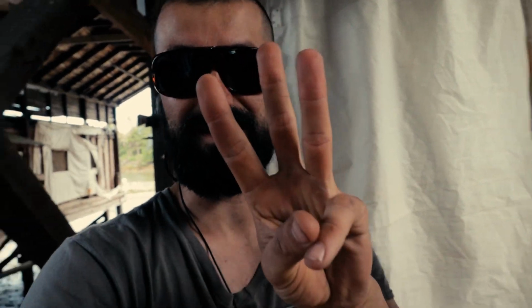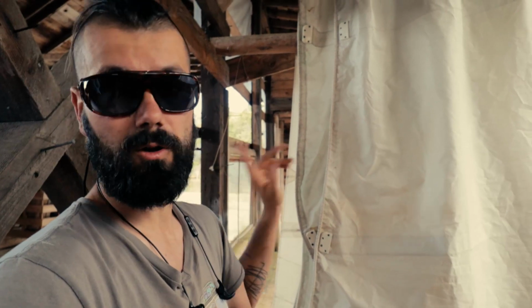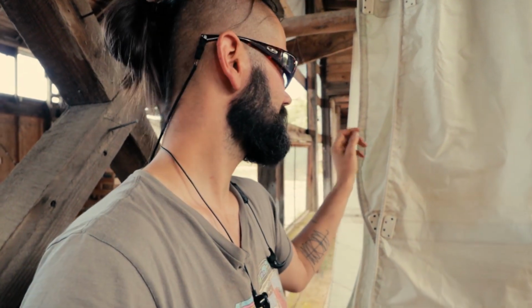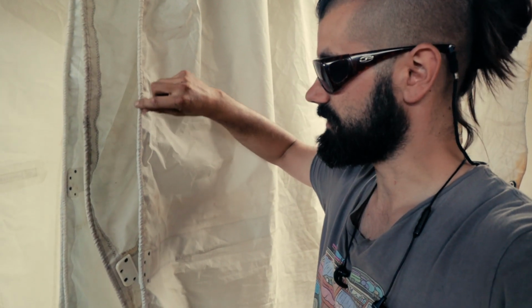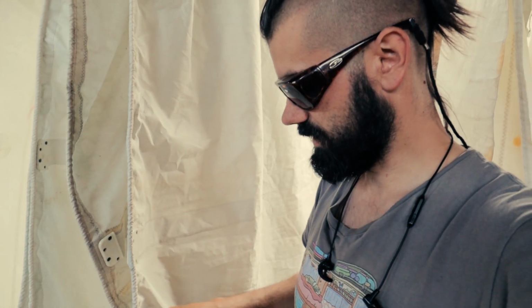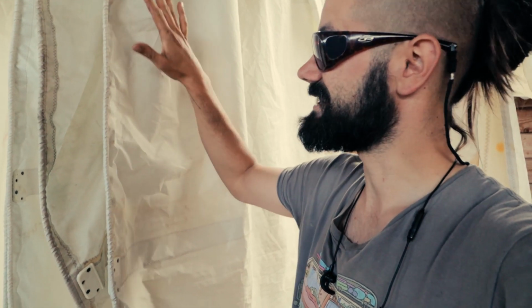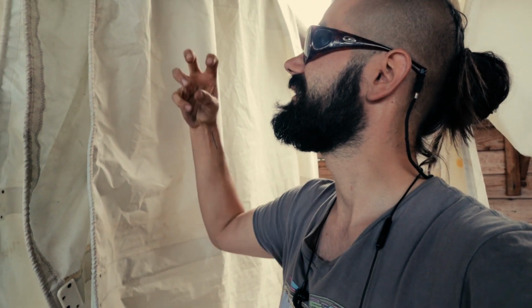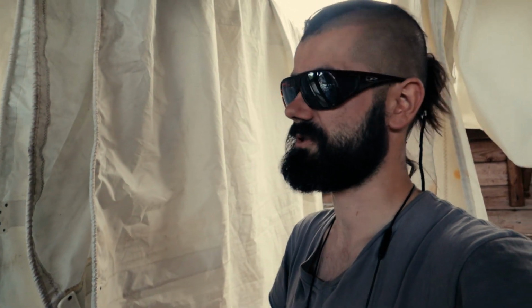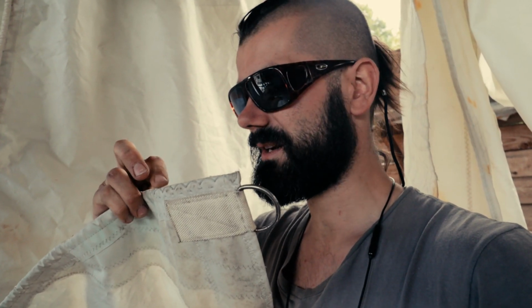Here, I actually have 3 sets of sails for this sailboat, so I took the cleanest ones and cleaned them a little bit more. But we're not quite done yet. Before I get to go sailing on it, the leech line here needs to be fixed. As you might notice, there's a lot of creases in here, and that's because over the years, the rope that fits inside of the sail actually shrinks, and the sail doesn't. It's quite stable. So as it shrinks, it squeezes the sail downwards and makes it baggier and harder to pull straight. So what we're going to do is cut these stitches right here. We're going to slide the rope up a little bit, and we're going to stitch it back in, and we should be good to go.